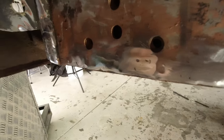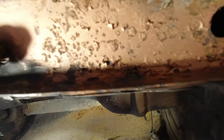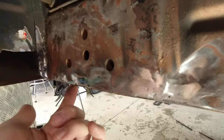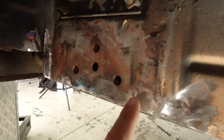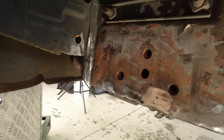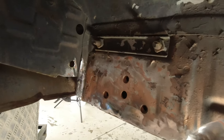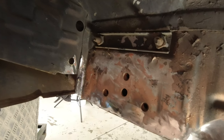Generally speaking I think that'll be fairly solid — it's closed up and it looks pretty good. These welds have penetrated to the back; you can feel that they've got the heat through them and they've peeled off the primer and undercoating that was on the back. It's ugly — or it was ugly. I had to grind those welds down a lot. I'm not a professional welder, and there are probably guys on the internet that could have fixed this a lot better and quicker, but I think that repair will be structurally sound. Now we just have to get the flap disc back on this, tidy it up, and put a coat of etch primer on there to protect it until we can get the undercoat on.